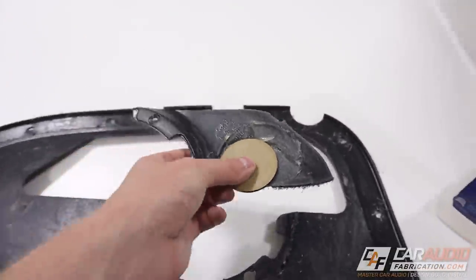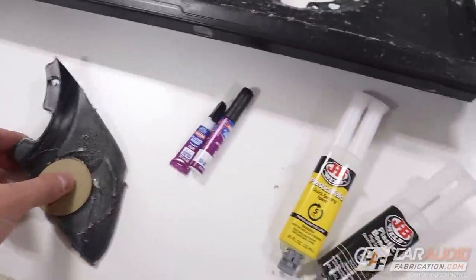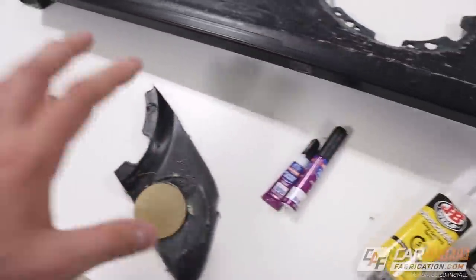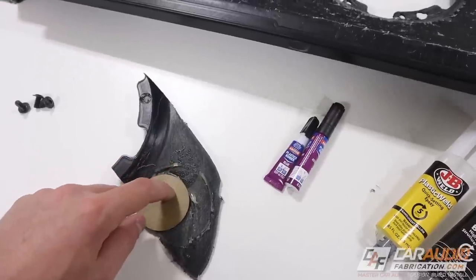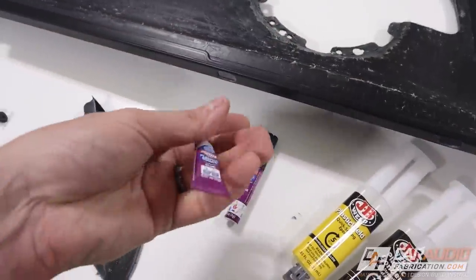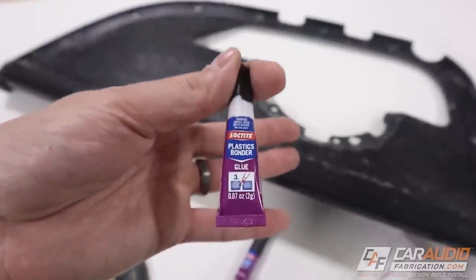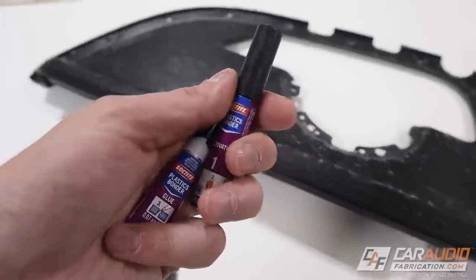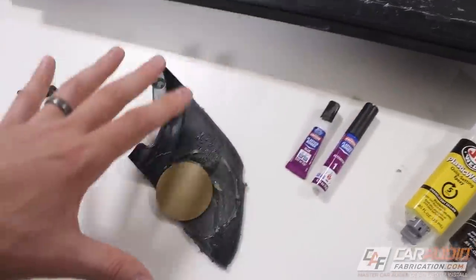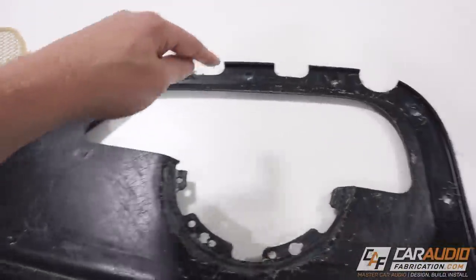In between videos I took a piece of scrap plastic I had cut out and a scrap piece of acrylic, and I tested some different adhesives to see which one was going to work the best. Unfortunately, the two epoxy options didn't really work all that well — I was able to pry the acrylic disc off. But this stuff here is something new that I tried. It's definitely a CA glue, but it's made specifically for plastics — they call it Plastics Bonder. I'll put a link in the video description. It works really well with this special activator that acts as a primer you put on the plastic before applying the glue. It's super hard to detach, so that's what I'm going to be using.